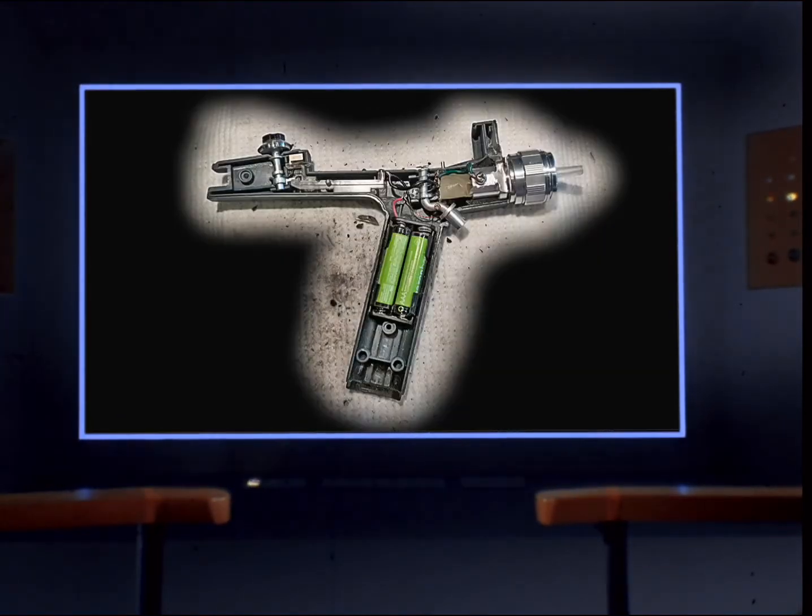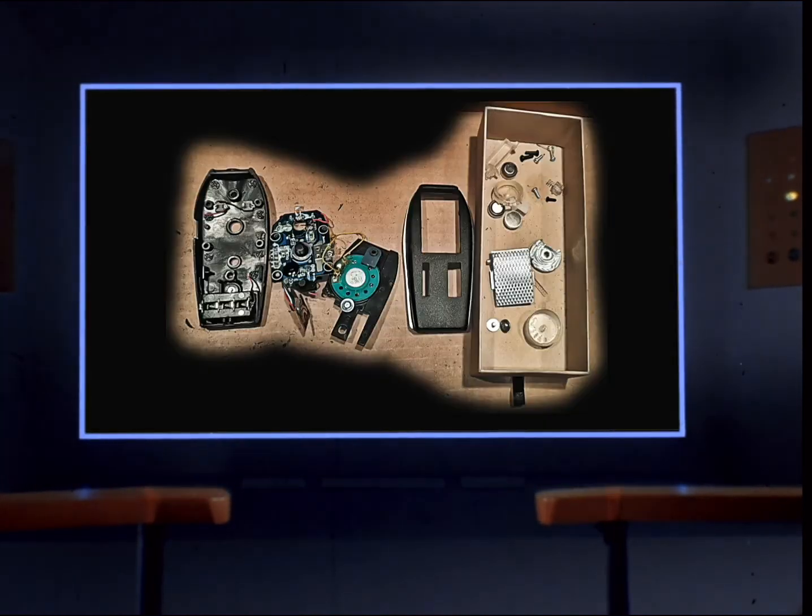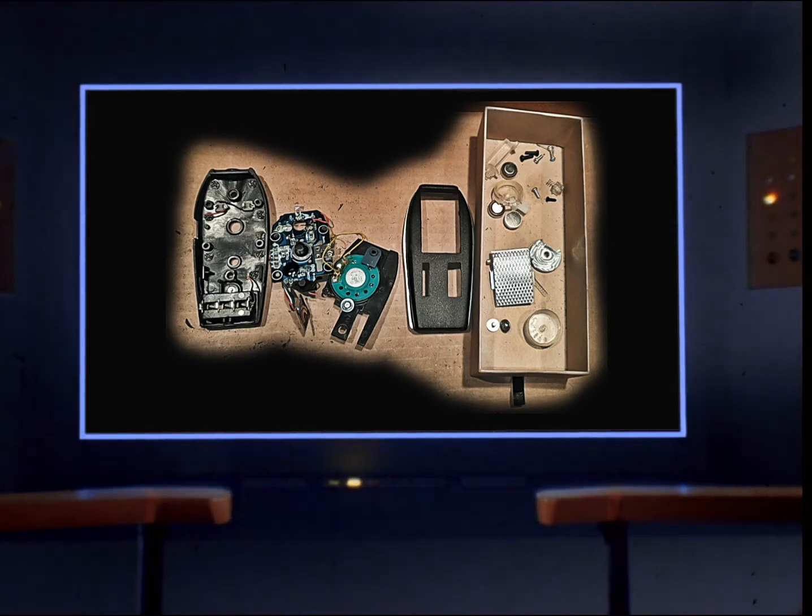Here's an image of the inside after completion. As you can see, I've added the battery pack, the laser module fits inside the aluminum nozzle. I've also had to rewire the trigger switch in order to accommodate the laser, and the metal pieces have replaced the corresponding plastic pieces as well. I basically had to go through the same process for the handheld part of the phaser — taking it apart, gutting it, repainting it, and putting in all the metal pieces.